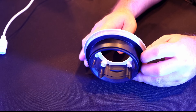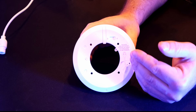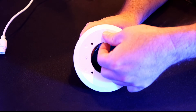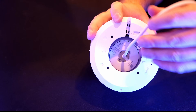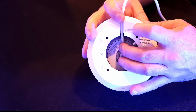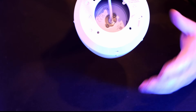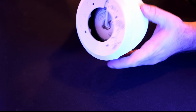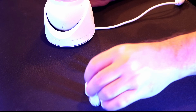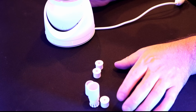It also comes with this mounting bracket, and what's really cool about this mounting bracket is it has a lock on the back. So if you're putting this up against the wall and not drilling a hole, we would take this little slot out. With the camera on the mount, we grab the cable, put it into the slot, and once it's in the slot, we push this little locking mechanism. Now this cable is fully locked into the camera. We also get a couple different grommet sizes depending on the cabling that you're using. You're gonna want to put all of this on to prevent water or dust from getting into the ethernet port.